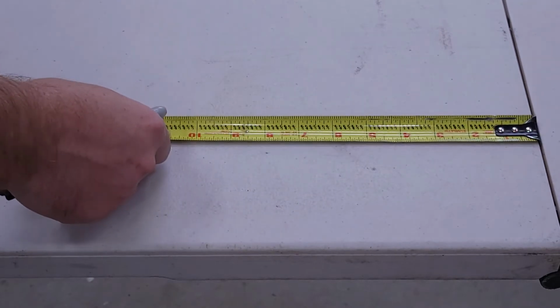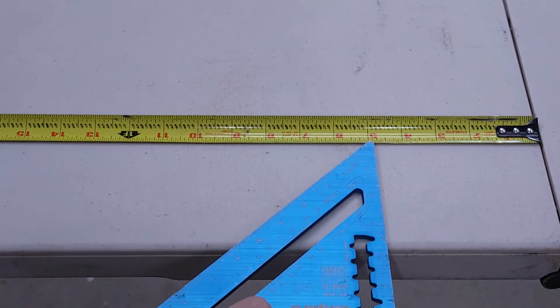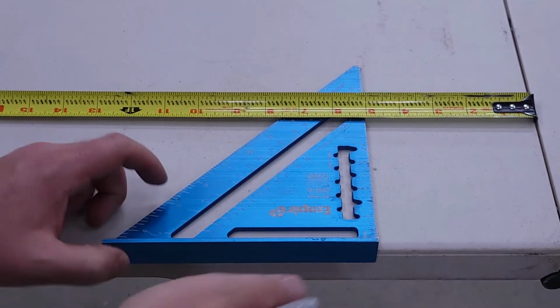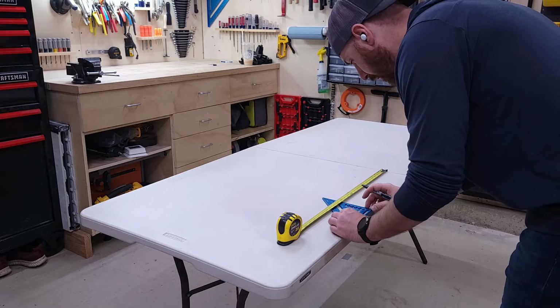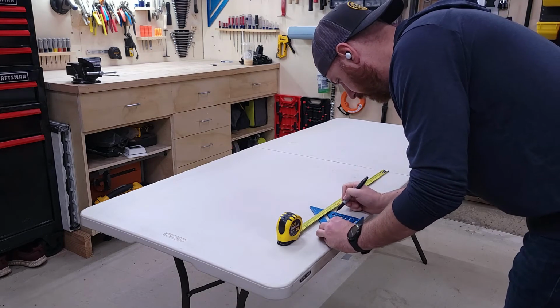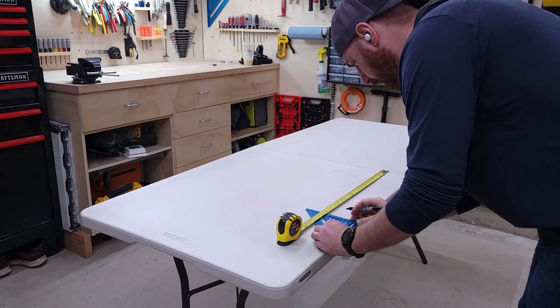So next, on the long sides of the table, I wanted to figure out where we wanted to position the starting hole. So I chose 5 inches, and with the playing deck card, we're actually going to drill a hole every 3.5 inches. So we're going to drill a total of 7 holes per slot. This will give us 6 slots for the cards on each player's side of the table.